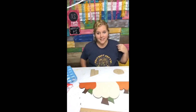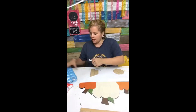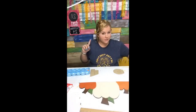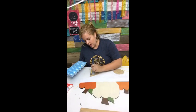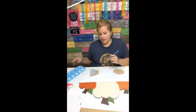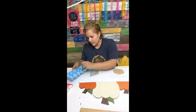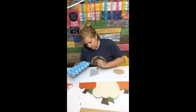Did you make your paint backdrop? Yes — it's made out of old pallet wood. My husband took a sawzall and cut up a bunch of pallets, we screwed a piece of half-inch plywood into the wall, then used a brad nailer to tack each board up there, and I painted them. I made it bigger later but haven't had a chance to finish painting all the boards — I've been too busy painting door hangers.